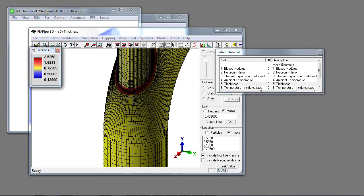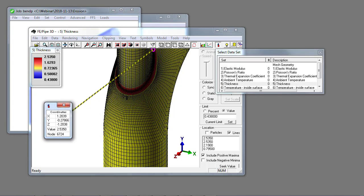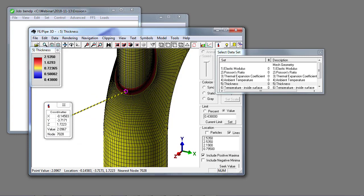I built this with a fairly fine mesh because I'm going to apply my thickness contour plot grid on the back side of the bend and want multiple nodes between each measurement point. I select the dataset and plot the thicknesses. I've got a gradient thickness to simulate the weld elements, and once I get to the toe of the fillet weld I have 0.718 inches, pretty much uniform on the extrados of the bend.